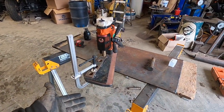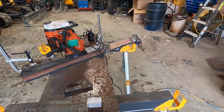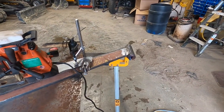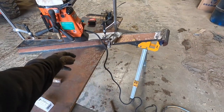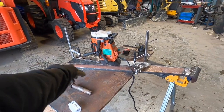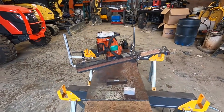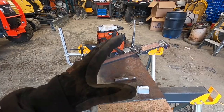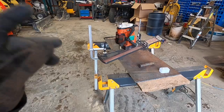This is my 32-inch pull blade for my new vibratory plow. It's not that much longer - this is 15 inches from here to where it stops hitting the dirt, so this is an 11-by-15 blade. This new one is going to be a 32-inch blade, with the bullet set at about 32 inches so I can plow in water line at 30 inches.